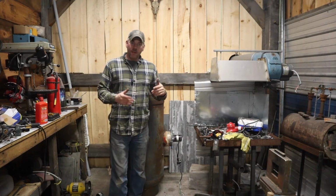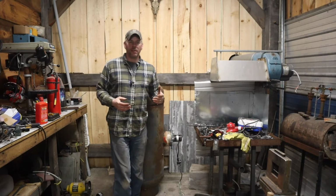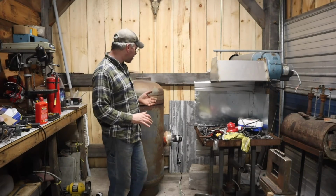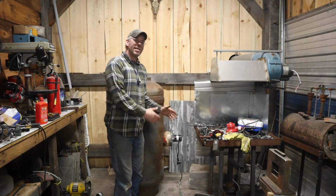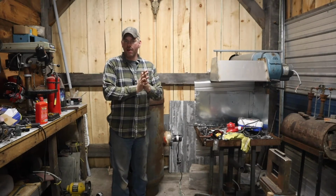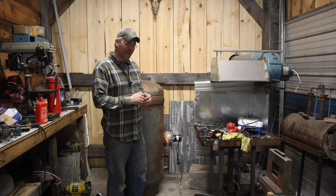So what happened, the fire got going nice. It started decently. Probably the sawdust I'm using isn't quite dry enough. There's a lot of green sawdust in there, even though it was last year's. It's been in a trash bag since last winter, so it really hadn't had a chance to dry out. But with the inducer motor, it should still suck the smoke out of there. I will say I was condensing a little bit, and that's probably because there was a lot of moisture in the sawdust. I actually had water dripping out of the exhaust pipe on the outside.